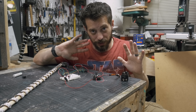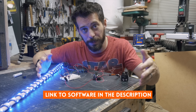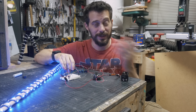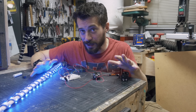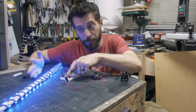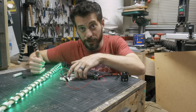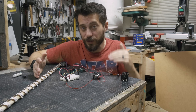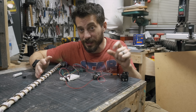Let's do a quick test of everything to make sure it works before I start putting it together. The first button turns the blade on — it animates the light up and plays the humming sound while it's on. Since there's a motion sensor in the prop shield, I can trigger swing sounds anytime it's moved. All of these sounds are just simple audio files that I loaded onto the prop shield. The other button goes through a list of colors I have preset and switches to a different blade color. Once you pick a color, it stays on that color whether the blade goes up or down. If you cut the power, it defaults back to the first color in the list every time — so if you want to always start out green or red, just put that first in the list in the code.